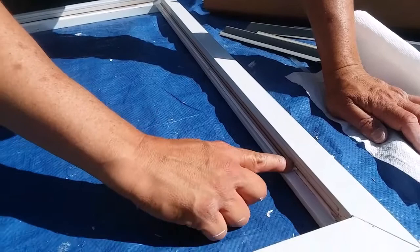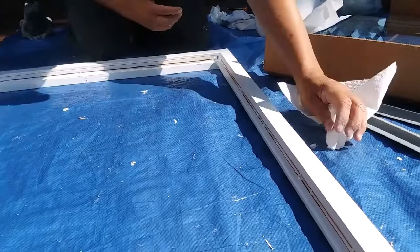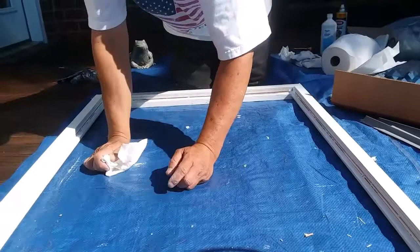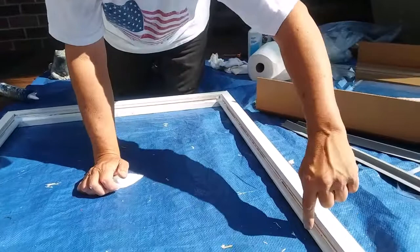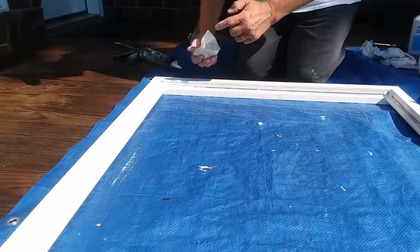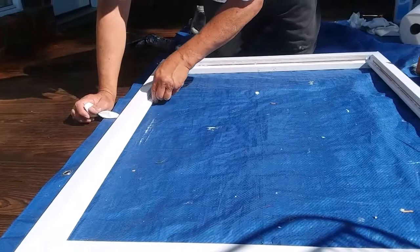One more side to go here. Once I've got the flat bead, silicone caulking gets tacky relatively quickly, so I don't like to spend too much time on it. I just try to make sure I've got a good thin layer, and then when I press it out toward the front, I go back and make sure I wipe off any excess — so I don't have as much cleanup to do later on that side.